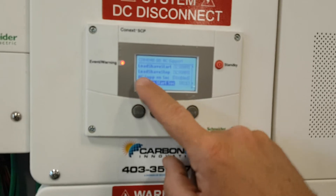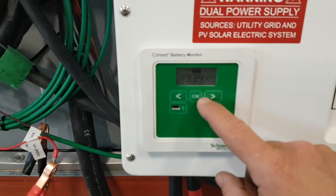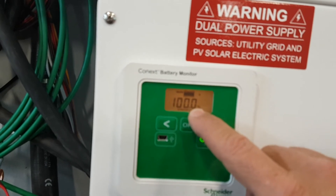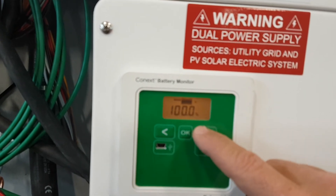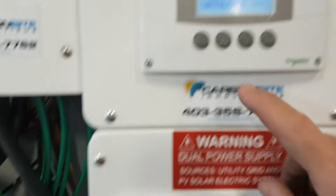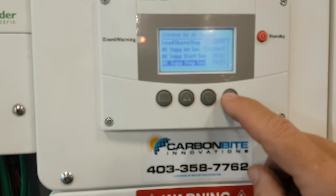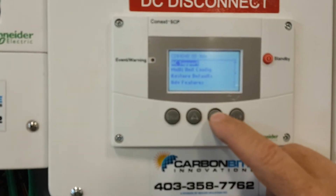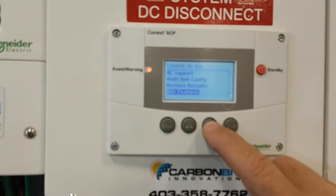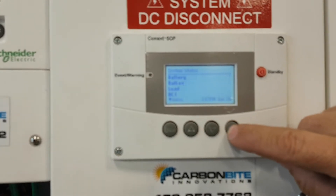Just leave the times alone. AC Support SOC stands for State of Charge, which will have a percentage — it's saying state of charge is at 100, but these batteries aren't fully charged; it usually takes three days to even out. We have that disabled, we're not worried about it. Multi-unit configuration — don't do that. Restore — don't do that. Advanced features — stay out of there. Exit.